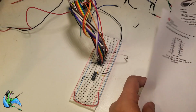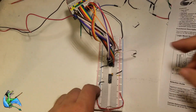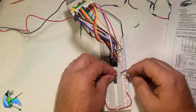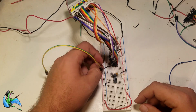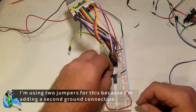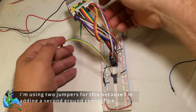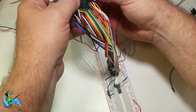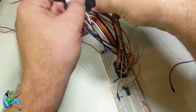Well, in a TRS-80 with 16K of RAM, all the memory installed in the keyboard is in the bottom half of the total 64K of address space available to the CPU. The first 16K is taken up by the 12K of BASIC ROMs, the memory-mapped keyboard and screen memory, and some reserved I/O space. And the second 16K is the dynamic RAM installed inside the keyboard. This leaves the top 32K empty.